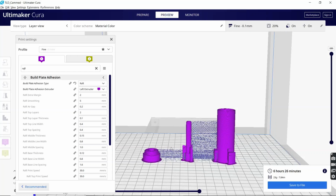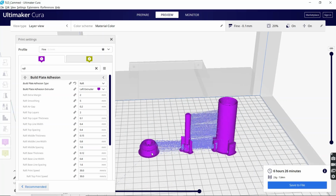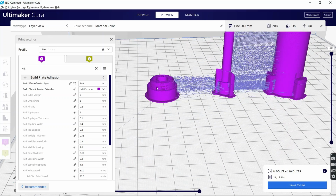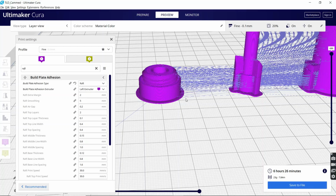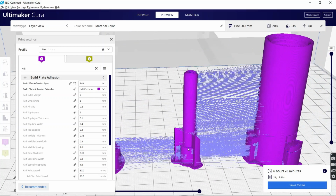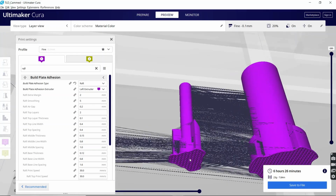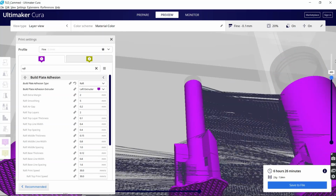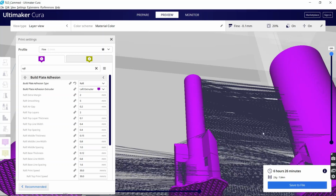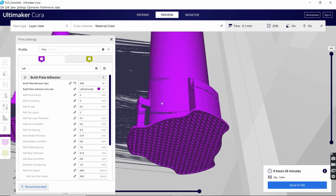Okay, here are the 3 parts that I 3D printed in Cura Slicer. This is the cap here. So you can see, if you look closely, it's got the threads pointing upward, and this part doesn't need any supports. The cam definitely needs some supports to get you the camshaft, and the ID also here needs to be supported to hold that spring in, and the barrel and the pusher needs a lot of supports, and this was actually kind of a pain to remove all these supports with the PLA clipping tool,